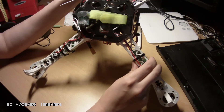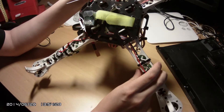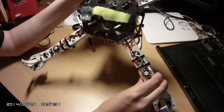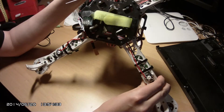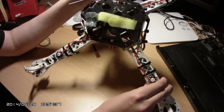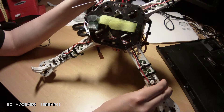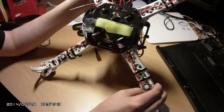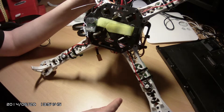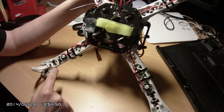Then to my actual hardware. I usually shop at Hobbyking, and they have selections of LED strips in different colors and lengths. You can get them almost anywhere, but theirs have the advantage of already having a JST plug. I bought six strips in red, green and white, two of each, and a ready-made power distribution cable, so it can be plugged straight to the balance plug of a 3S battery.